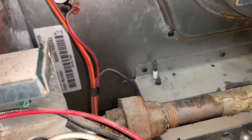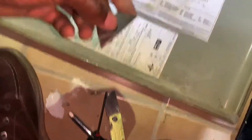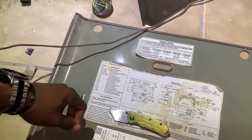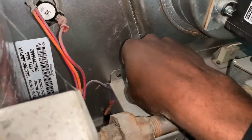I already solved the problem. You can see I have my flame sensor wire disconnected because I want to demonstrate what actually happens. What I did was pull the flame sensor out and used my blade to scrape it — scrape the flame sensor clean, get off all the corrosion and get it nice and shiny. It's best to use small grit sandpaper or emery cloth to clean it off. Note: this is for pros only, not do-it-yourselfers, because this stuff is dangerous — if you don't know what you're doing you could burn your house down.